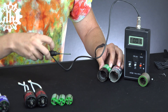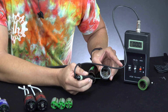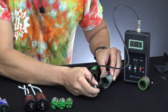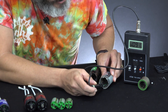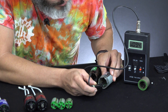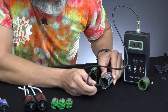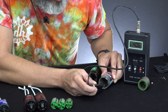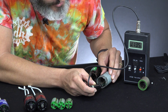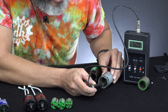Why is this? The majority of the difference is the magnet strength and quality. We're going to test the Brand T motor with our Tesla meter so we can see the strength. I'm going to put the meter right in the middle of the magnet. We are looking at about 109 milli Tesla — around there. We move it up and down just a little bit, about 110 milli Tesla. Then we move to the edge of the magnet, and this is where it's important — the magnetic field is dropping off extremely fast. When we get to the edge, we're only at about 40 milli Tesla. Back to the center, about 110. For consistency, we go to the other side and it drops off — about 50 milli Tesla on that side.